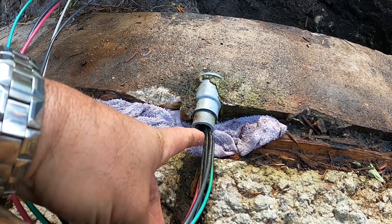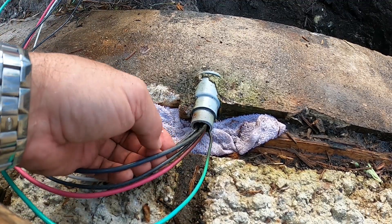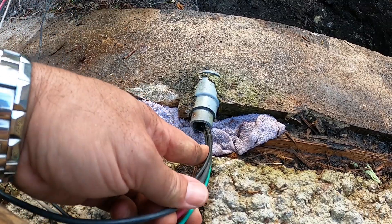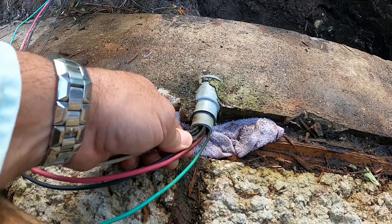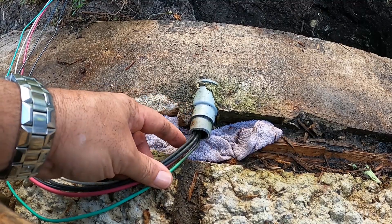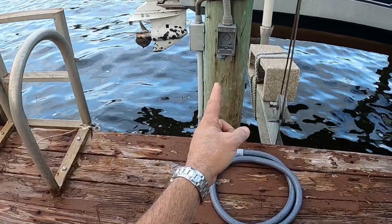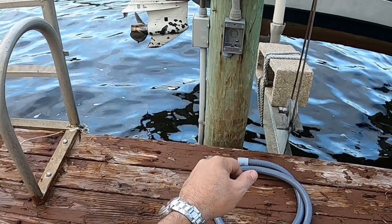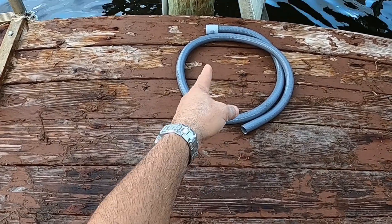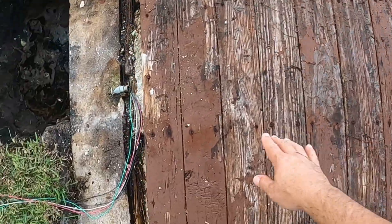There's just a little bit of damage to the clear plastic coating on the wire. You have the copper, then the insulation on the wire, and then there's like a clear coating — that's what you see right here. We don't see any problems with the wire; nothing's been cut. We're going to put a little bit of a bevel on here, and then I'm going to use PVC cement to put on a coupling so we can slide on a whole new section over these wires. We now have a new weather-resistant box in place, screwed in with stainless steel screws, with liquid-tight connections going into the box.